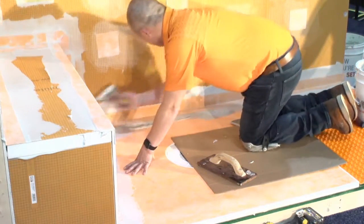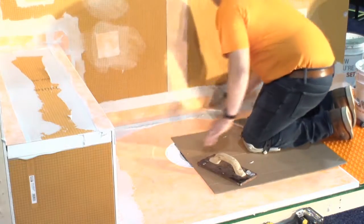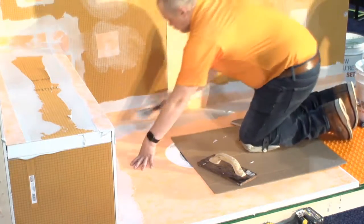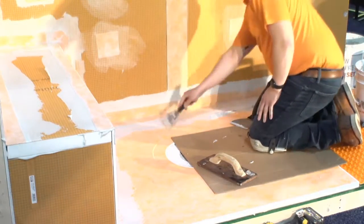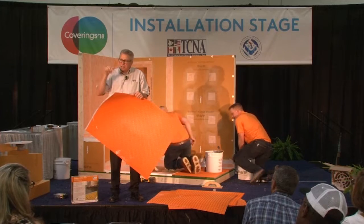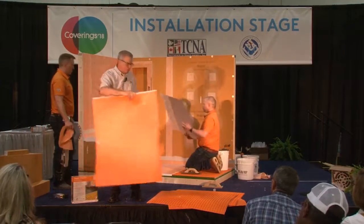Many of you understand the whole idea of efflorescence. And efflorescence is what? Moisture coming back through the top of the tile, namely through the grout lines, and bringing the binding salts, the calciums, the limes, with them to the surface. The water evaporates, leaving the calciums around. That's your efflorescence. We can't make the claim that this will completely eliminate it, but it will certainly greatly reduce the capability of any efflorescence coming to the surface, because the water has a course of least resistance down through the bottom and out, plus the ventilation layer to help dry things out. So exterior applications is what DITRA Drain is for, so keep that in mind.